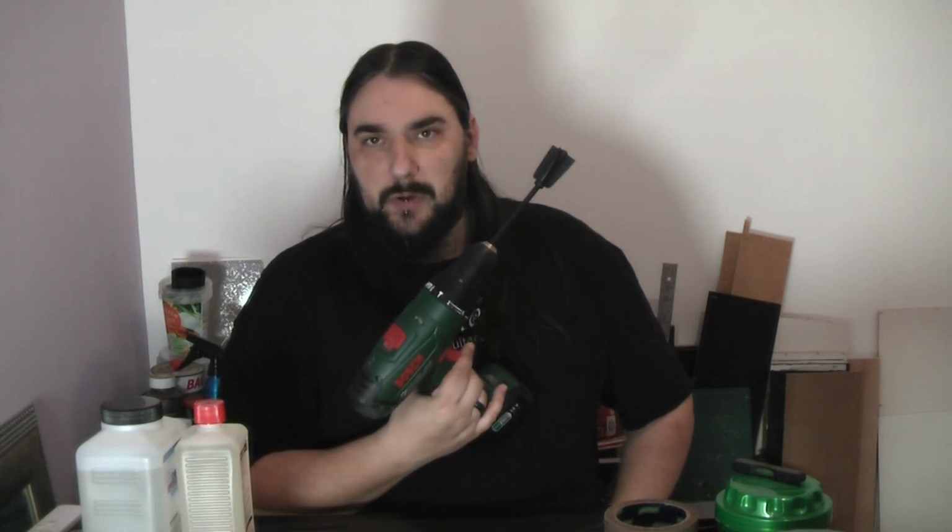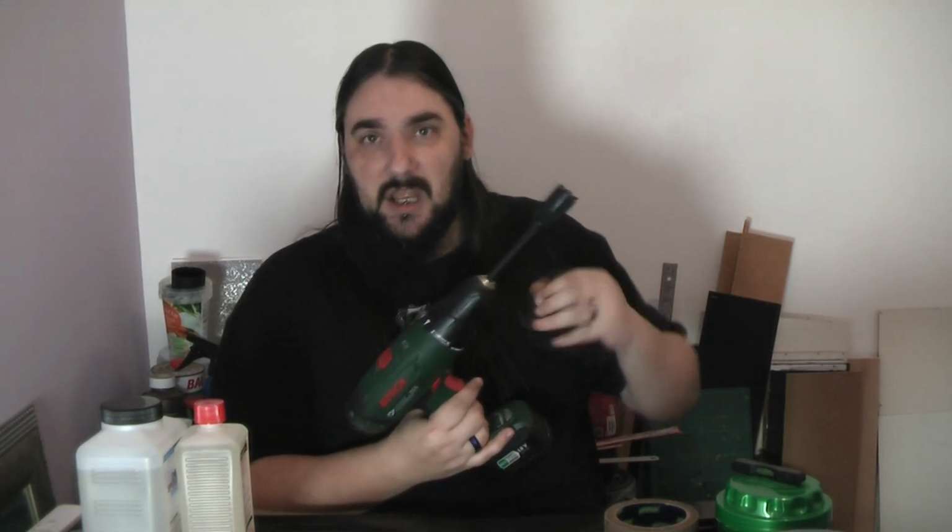So it tells you, this one is quite specific, you mix in a mixing cup with a stirring rod. You can get certain resins where you can use mixing paddles. These are simple little plastic paddles that you can mount to a drill like you see most people do online. Now, if it says that you can do that, then it's fine. A lot of these actually tell you a speed at which you can mix, you know, 30 revolutions per minute, 700 revolutions per minute, whatever. If it tells you it's got a half decent speed for mixing, go for it. If it tells you to mix it with a stick and a cup, you mix it with a stick and a cup. These things might look great for YouTube, but if you put 4 tons of air into that resin, then you're going to get bubbles all over the place.